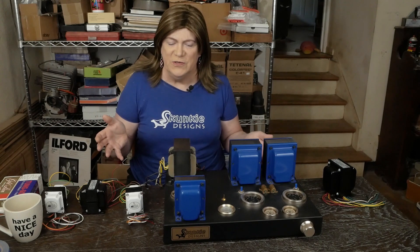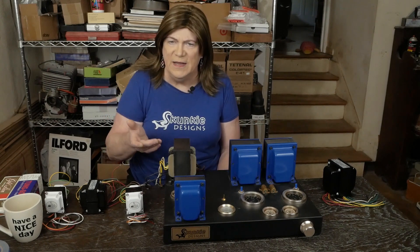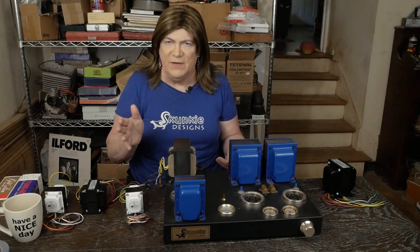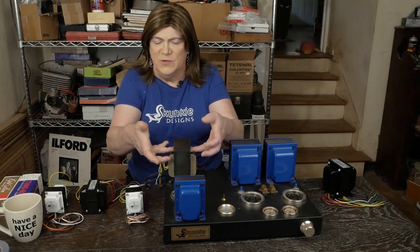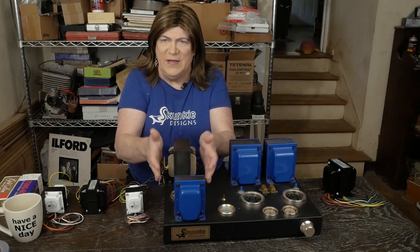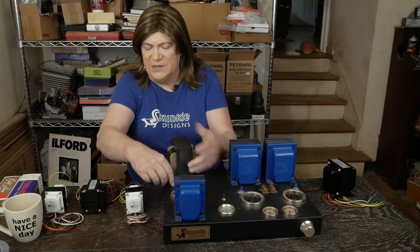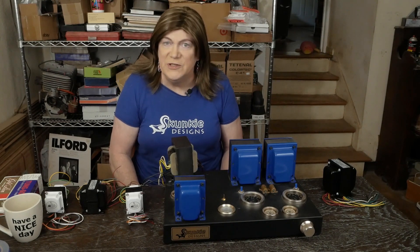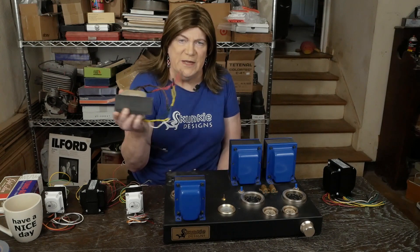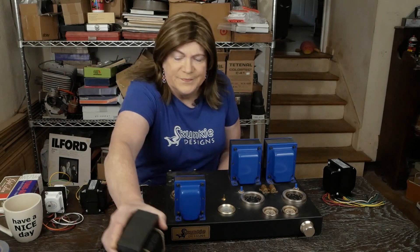The main problem I've had with Edcore is their power transformers, especially the one I used on my 300B amp. From the day I plugged it in, it was noisy and had a hum. I tried everything to quiet it down — popsicle sticks between the windings and laminates, deadening material on the end bells, and ultimately mounting it on little rubber stands. That helped, but then in less than a year the amp started blowing fuses and this monster transformer was dead. It was expensive, and now it's in the trash. That's obviously not ideal.